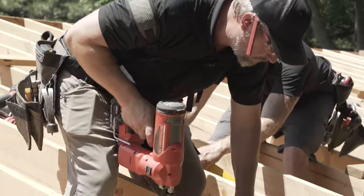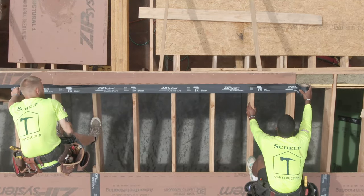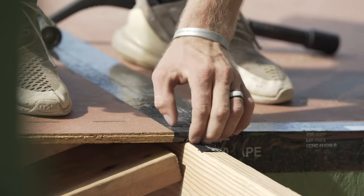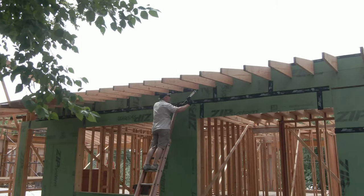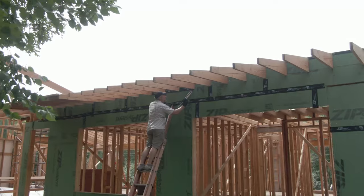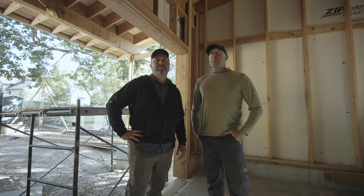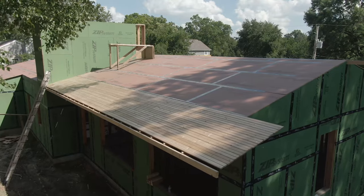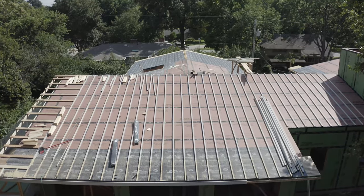We'll tape it to the boxing on the side wall, then it'll go right over to our zip roof sheet with liquid flash around the rafters, and that detail will be complete. That completes our air and water control for our ventilated over-roof. What happens next is a little more convoluted than your typical build, so make sure and check out our next videos here at the Prairie Village Fine Home Building 2022 house.